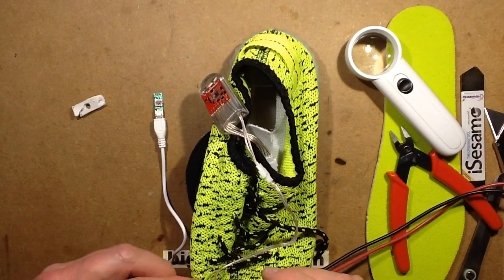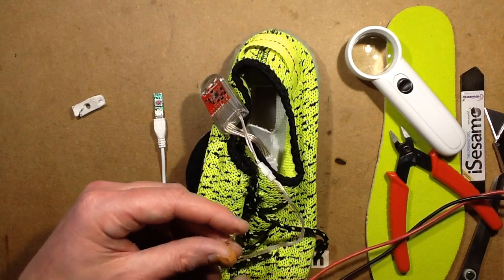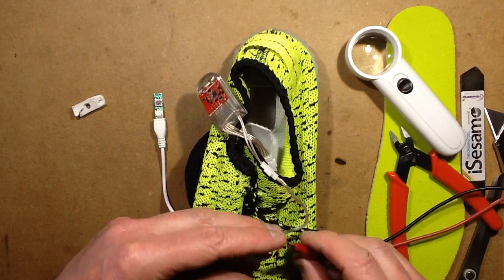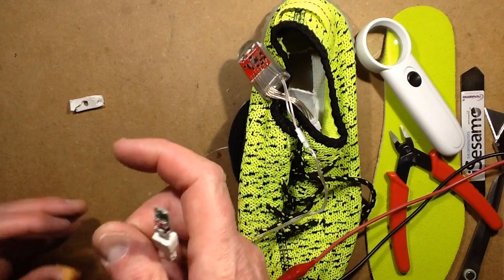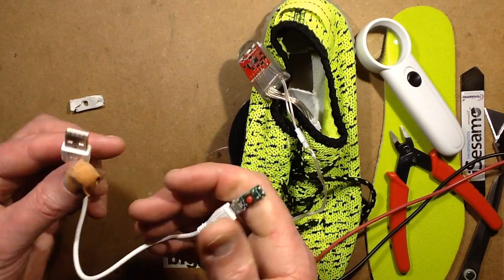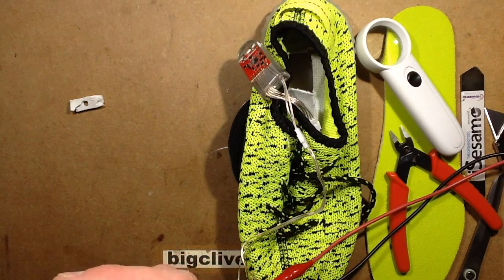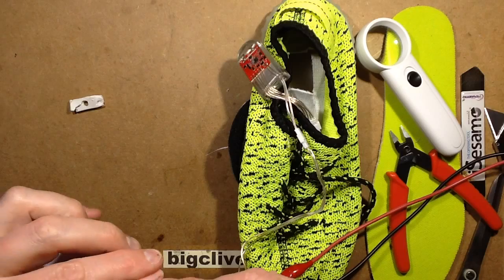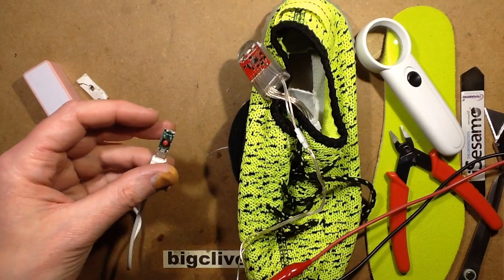So I'm just going to turn this off, actually. Shunt it to put it off. Let's put it in charge again. So that's charging at about 115 milliamps. So I've plugged this into this. Let's get the meter in this and plug it into a generic USB. Let's bring in the usual suspect, the pink USB power supply. And we'll check if we're getting anything out in this connector.